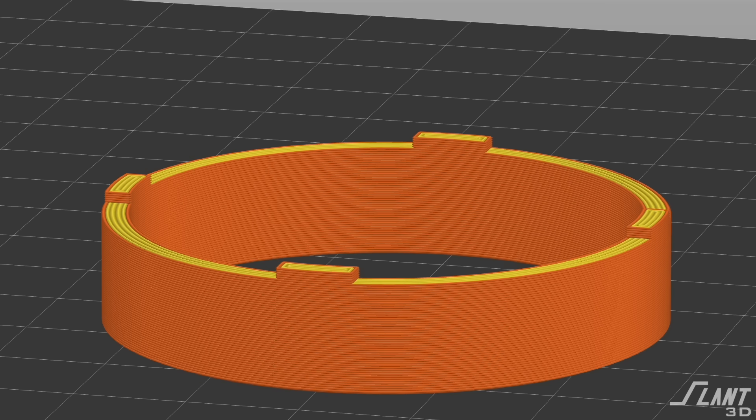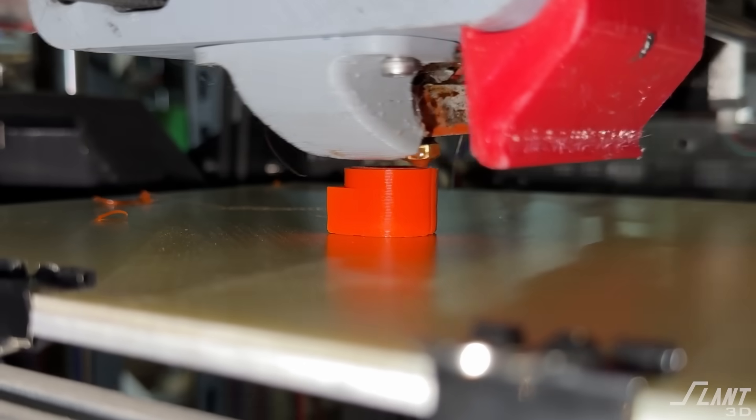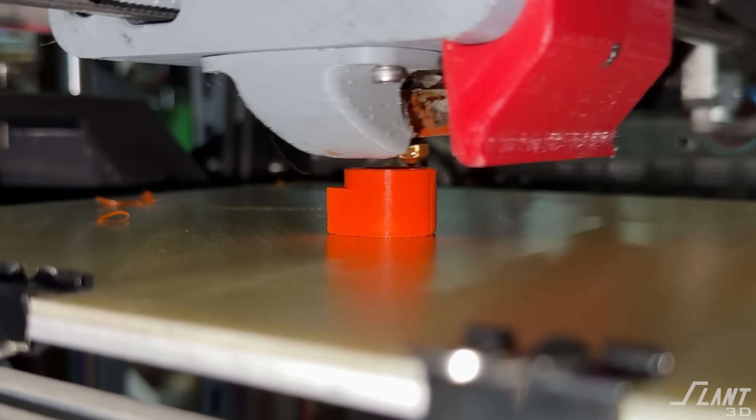However, if you're stuck printing it like this, there are a few things you can do. First, you can change the material — don't print it in PLA; print it in something like PETG or nylon so you get a little bit better layer adhesion. On our side, we're able to experiment more and make those stick a whole lot better if we're allowed to over-extrude and if tolerances are really low. There's a way to get it printed like that with really good layer adhesion, but then the surface finish might get messed up.